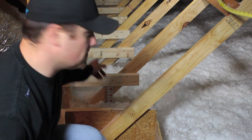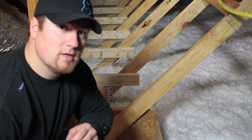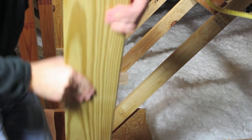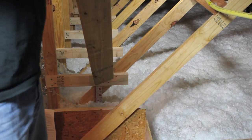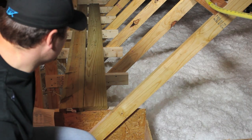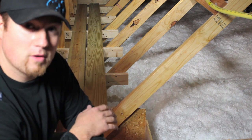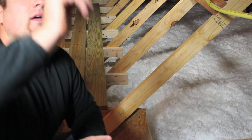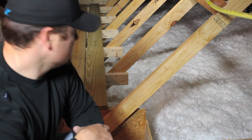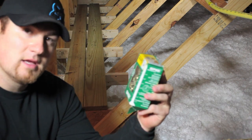Just like that, you put up your support boards, and now it's time to get some decking or some regular boards — whatever you have around the house. I'm going to use brand new deck boards so I know they haven't been sitting outside and gotten rotten or gotten any termites or bugs in them. When you choose your board lengths, you may think you need a big 14, 16, or 18-foot board, but if you can't get them up through your attic hole, it won't do you any good. I got 12-foot boards to make sure I was able to get them through my door. Now I'm just going to take some 2-inch screws and secure the planks.